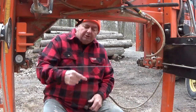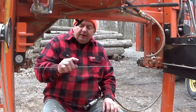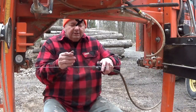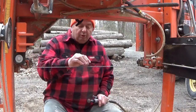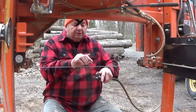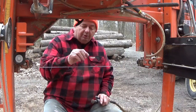It's important that you see a straight line of shining. If you see black along the face that you just sharpened, then you're not sharpening quite right. You've got to adjust this as you do it. And it doesn't take much off. No, I'm not wearing glasses, but if you want to wear them, okay, I just can't see with the glasses on. This little bit of spark coming off here is not much, so I'm not worried about it, but that's my own opinion.